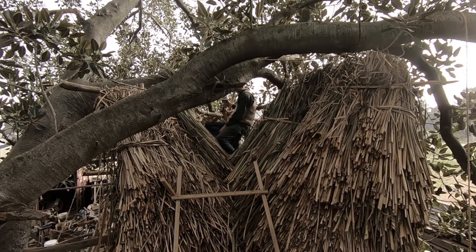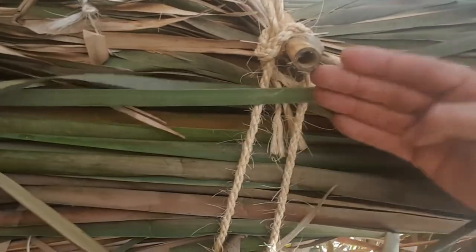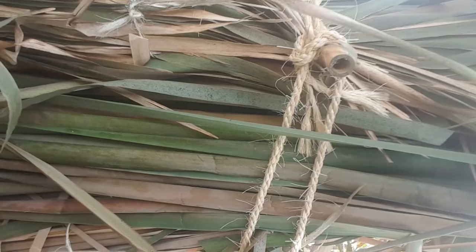I reckon I'm going to need the better part — if not an entire — another trailer load to get this bit finished, at least to get the second last course done. Because this corner that I'm sitting in is probably a whole trailer load of volume of thatch, because I've got to pack a lot of this up — without even thinking about waterproofing I just got to fill this void up so that I can then lay the waterproof layer on top of it. I think one of the reasons it's taking so much material is my experience: the layers have been getting thicker as they've progressed back to this corner. It's just this huge massive hole here that I've got to fill all the way back to there.